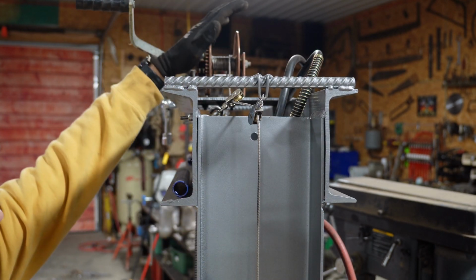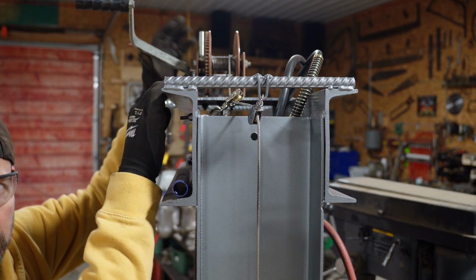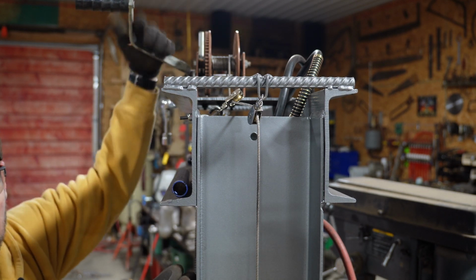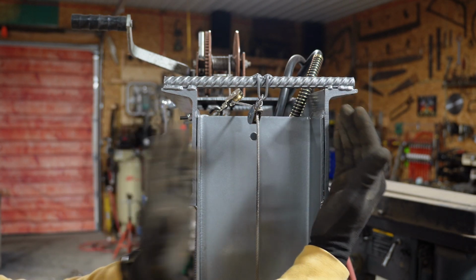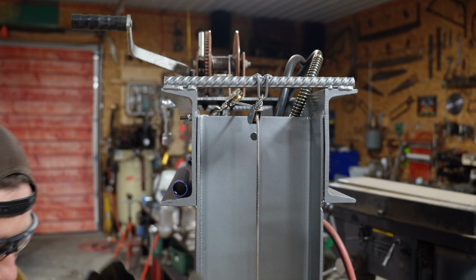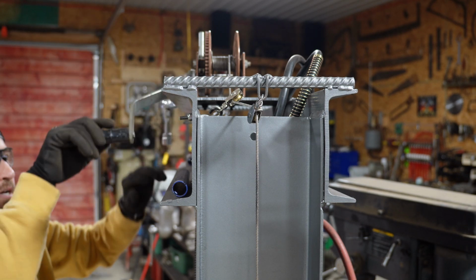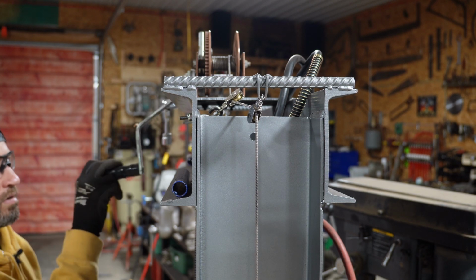And that's because the winch itself had to be offset. Now, when you see guys do this with a 20-ton shop press, you can center this winch on that and the handle doesn't hit anything. But with this wider base or wider C-channel that they use on the 30 tons, it just doesn't work. And I suppose I could have extended the shaft out a little bit so that the handle was out, but I needed the handle to be able to clear that top crossbar.